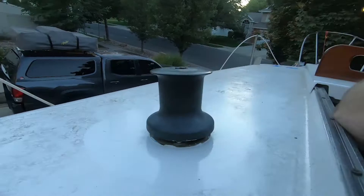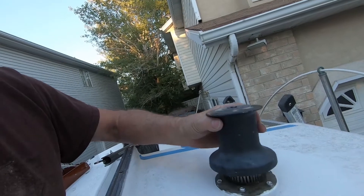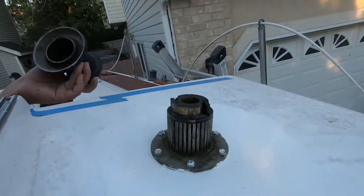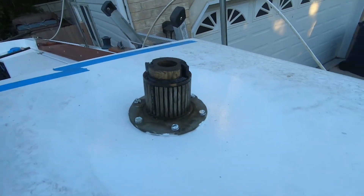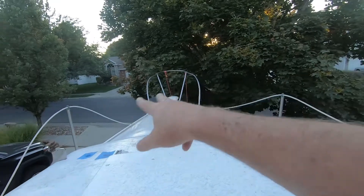I feel like I'm going to be able to add a new skill to my resume: a person who can put down blue tape around stuff so the rest doesn't get goopy. There is the main cabin top winch — not much to it, and obviously it'll need a fresh blast of grease — but it is screwed down, bolted back in, and has the 5200 sealant around it. Sam and I worked on all the front of the boat yesterday so we have all the stainless steel mounting points sealed up with our 5200.